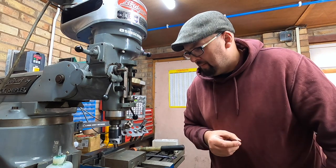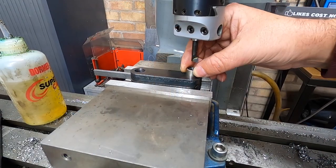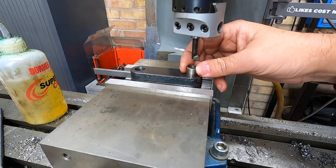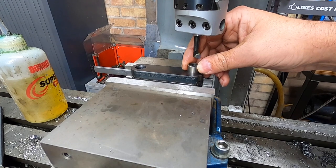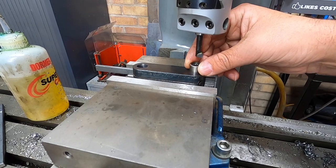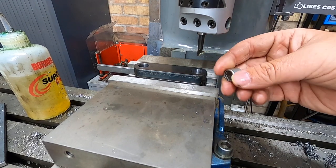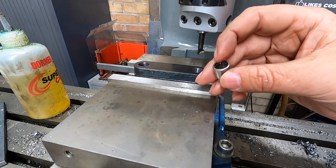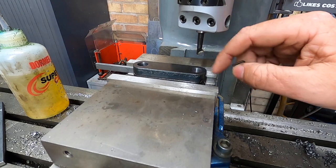It's taking its time though. I've got another one to do on this yet. It's quite tight. I'll start the other one and then I'll do some measuring on this and double check. But it does go stiff — I want it a tight fit, sort of a press fit, so that it's the needle rollers on the bearing doing the work, not the outside casing or the hole moving around.